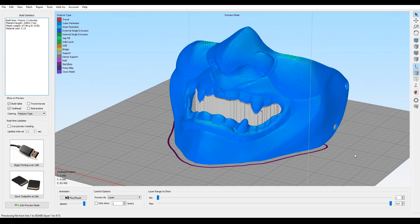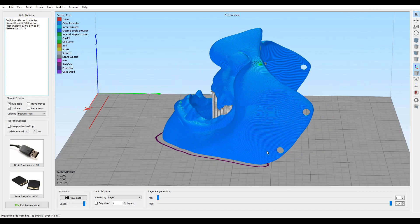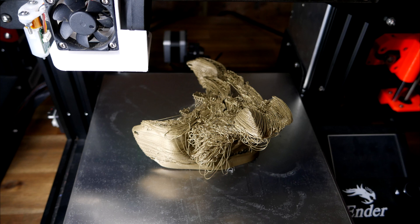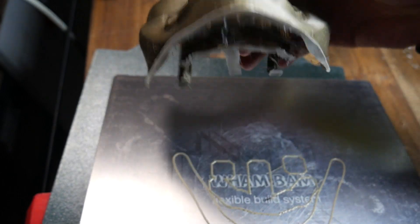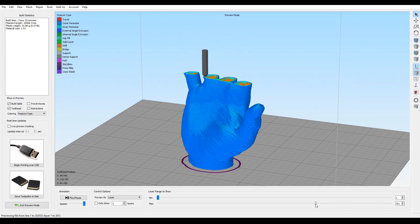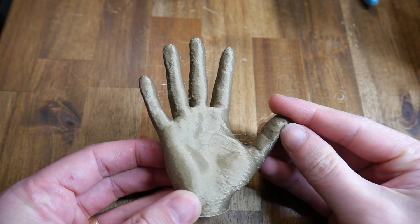Next up was the mask and I lowered my hot end to 190 and the bed temperature to only 50 degrees. I also manually placed support underneath the whole front row of teeth and joined them all up so they wouldn't topple over. I switched to a Wham Bam PEX sheet and 50 degrees was too low with the print detaching. I upped the temperature to 60 in the g-code and reprinted, and this time it peeled off quite well — still sticks as if there's a layer of glue underneath but very manageable. Finally the hand, back to 0.2mm layer height, a nozzle temp of 190 and I experimented with the bed at 56 degrees — this print stuck well and separated cleanly.